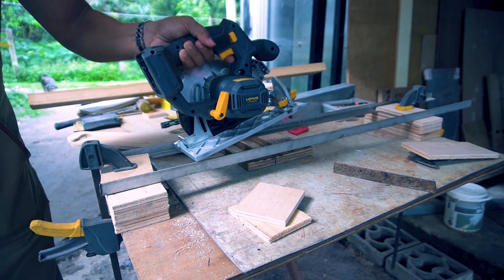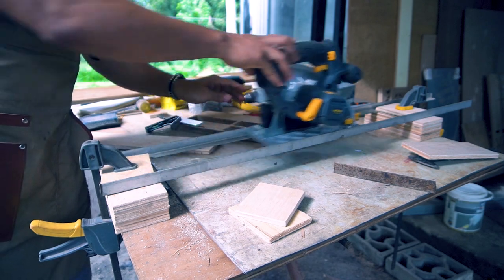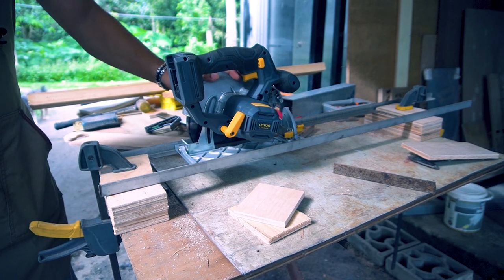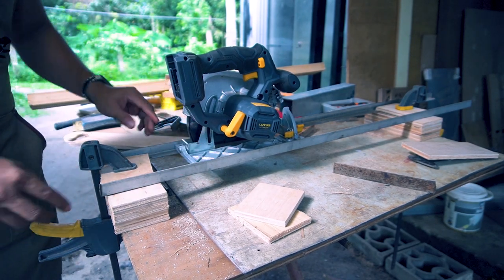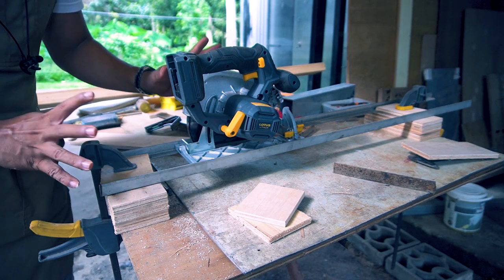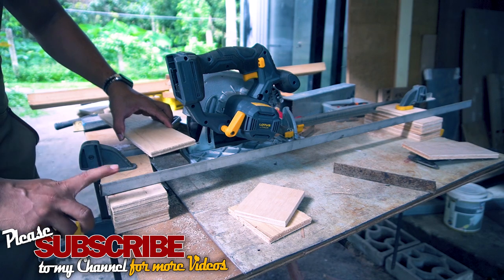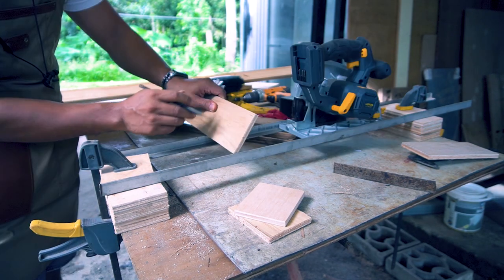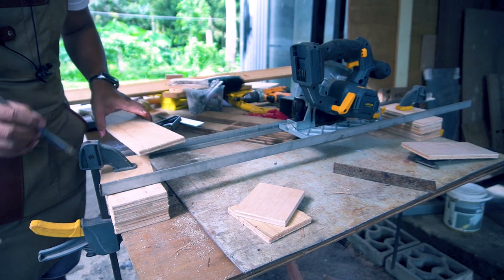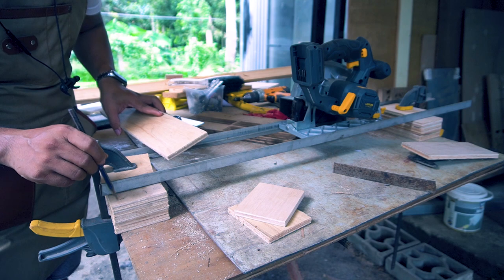As you can see, here is the circular saw on the setup. So far the rigidity is okay — the whole table does move a bit but I think the stainless steel rail is secure enough for this setup. I'll be using this to cut the spacers that will clamp the stainless steel into the riser. I'll measure the distance — there are two on this side and also on the top portion. I'll be screwing a plywood piece to clamp the stainless steel into this riser.